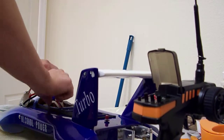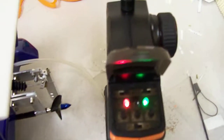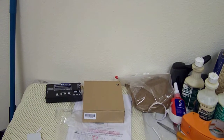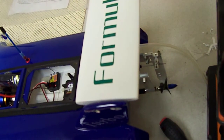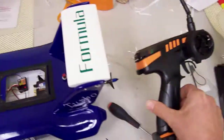Now that light is solid. Unplug the battery, take out the binding loop, turn the remote off, turn the remote on, plug it back in, and now everything works. That is how you connect one of our 2.4 gigahertz remotes to a receiver.